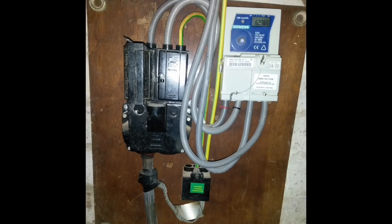The final example builds on the skills from the previous two parts. When you go to the mains end you see instantly that the incoming supply authority's cable has a conductor off it going into an MET — so we're off the sheath of the supply authority's cable and we're thinking the earthing arrangement is TNS. However, looking from the MET up, we see a green and yellow earthing conductor being connected into the cutout, and that would be connected into the neutral within the cutout. So this system started off life as TNS, but the supply authority has upgraded it to TNCS by adding a connection from the neutral within the cutout back down to the MET. The supply authority has also provided the 16mm earthing conductor and double insulated meter tails going through into the installation.